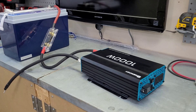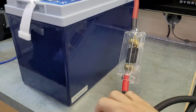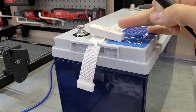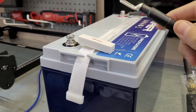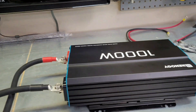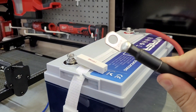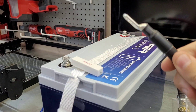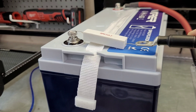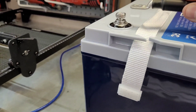To start off, we're going to connect the inverter to the battery. I've got the fuse in the positive side, and before I connect the negative to the negative side of the battery, I've got a little resistor installed here just to eliminate that spark. When you connect the negative there's going to be a large inrush of current to charge up the capacitors in the inverter — it'll cause a pretty big spark, it can damage your terminals, and it could get you in the eye. So always wear eye protection. This resistor should take away the spark.